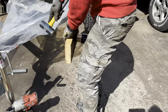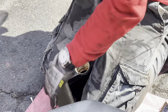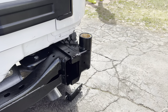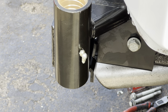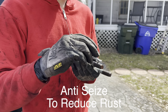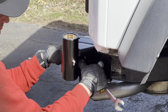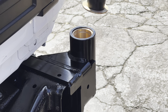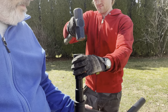One step in the installation process is to install a bronze bushing, and that proved to be quite a challenge. Lightly tighten the spindle mount into place so you can adjust it and move it around if needed. Matt had trouble getting the brass washer onto the spindle, so he used a very large socket to gently tap it into place.